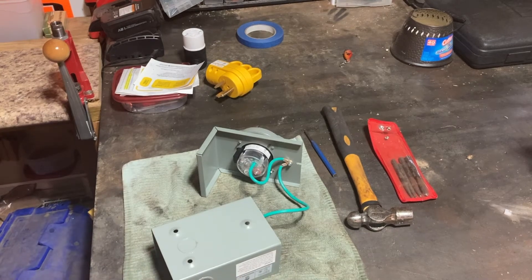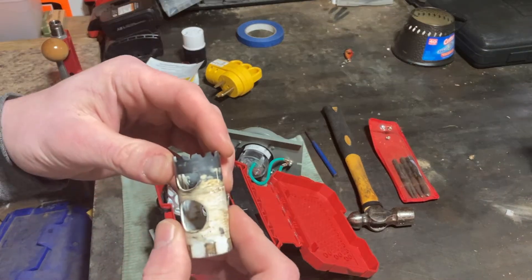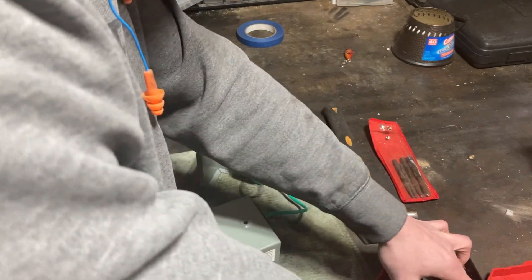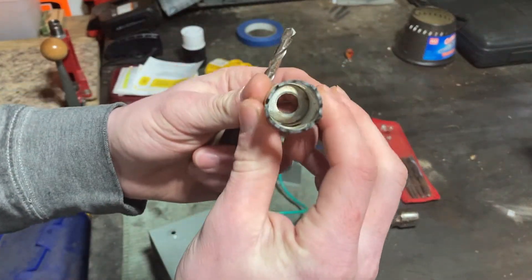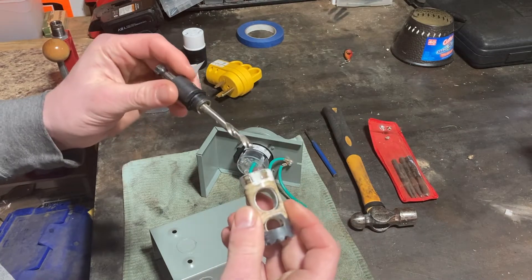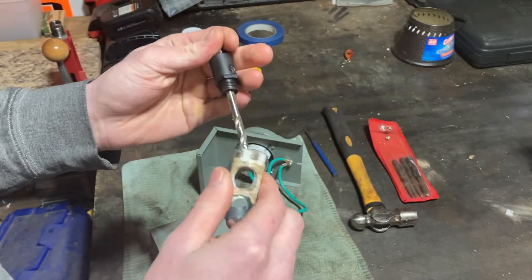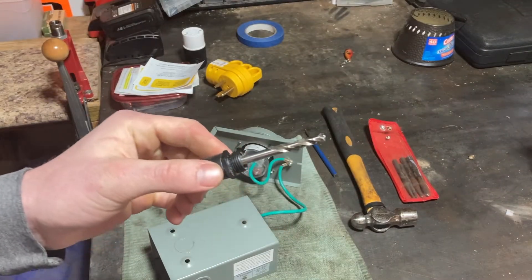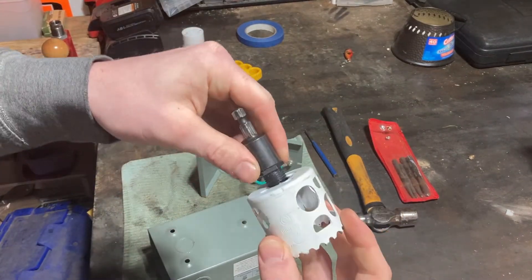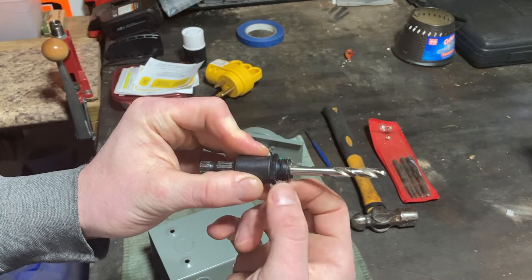I've got a hole saw bit kit right here, and this is your half inch bit. If you've never used a hole saw, all they are is just a drill bit that drills large holes. They all have a pilot bit — the pilot bit has threads here, and then you've got threads on the back of your bit and this screws in. This one has two different threaded pieces: for these bigger bits, that's what that one's for. For the smaller bits, there's threads under this threaded piece right here that come out.